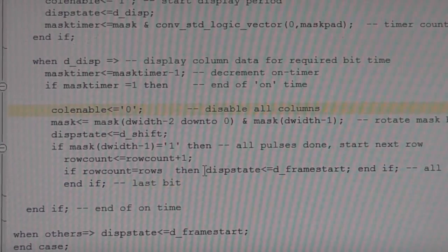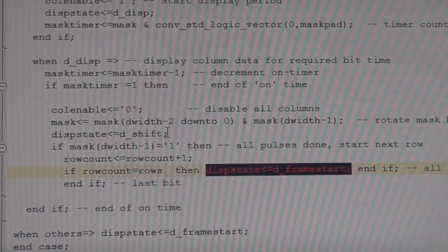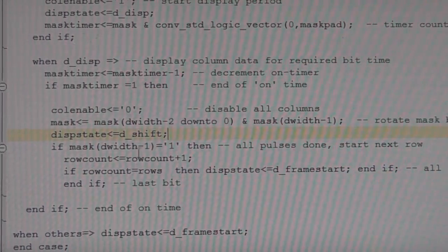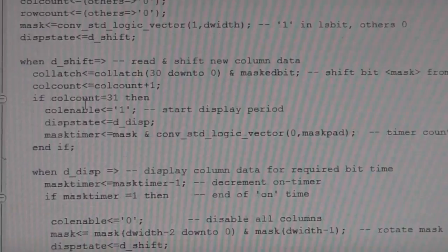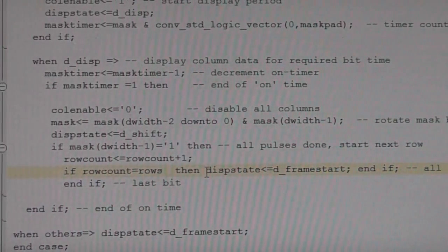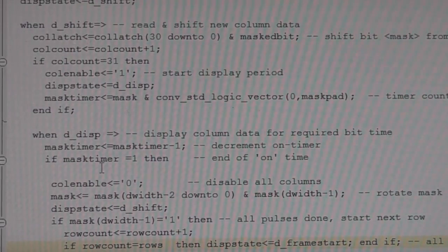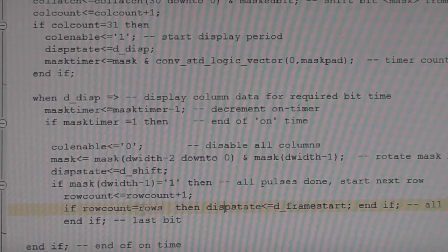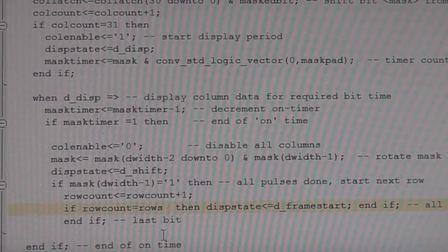So what it's actually doing is generating logic that says, if this condition is true, that basically overrides this statement. If you just think of a tree of logic gates, as you go left to right through the progression of those gates, you're moving top to bottom here in terms of priority. So the last thing you do, the latest thing in a process, has the highest priority, and that will override anything that happens previously. But this is not happening as a sequence in time, it's all happening effectively in parallel, just arranged so that the things which are written down later happen at a higher priority.